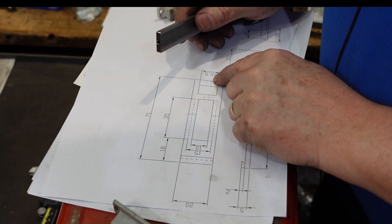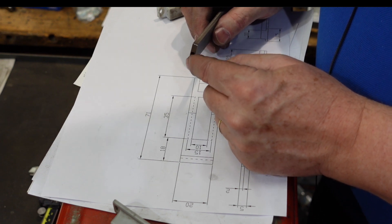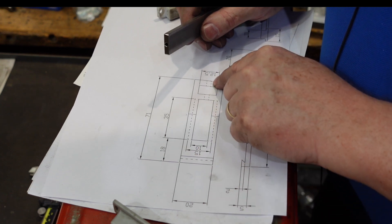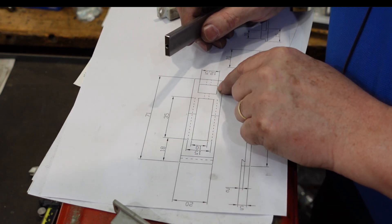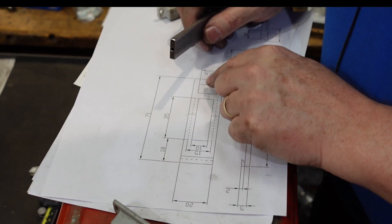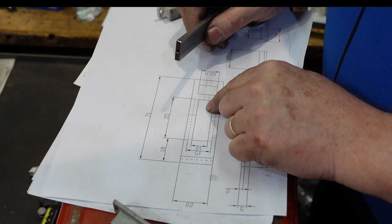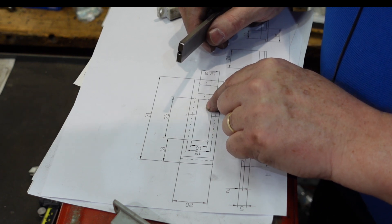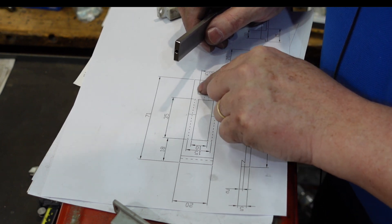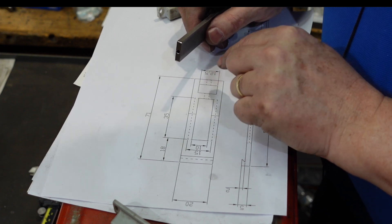The first operation I'm doing is putting the hole in the end here — that's just a 3.2mm hole, it's clearance for an M3 thread. Many years ago I did a video on the importance of sequence of operations, and the reason I'm putting that hole in before I put these cutouts in is simply that if I put those in and then try clamping the part in the lathe I may twist it, distort it, or put it in the wrong spot. It's only clearance so position is not as critical, but I'm now going to go along and put these rectangular cutouts in — that will bisect that hole, but that's what it's meant to do.